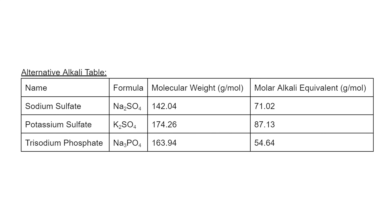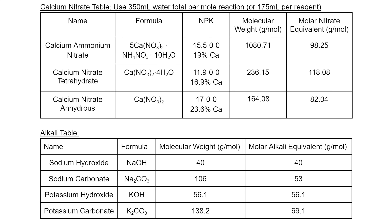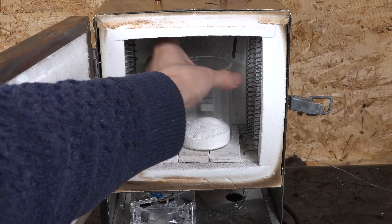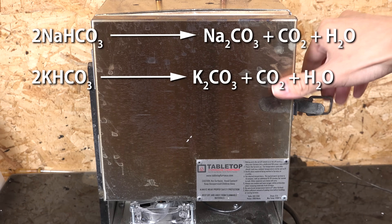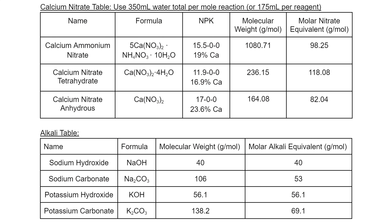If you want to use sulfates or phosphates left over from other experiments, by all means use extra water to dissolve them completely before mixing them in. If you're using any carbonates or bicarbonates like potassium bicarbonate or sodium bicarbonate as your alkali source, first bake them in an oven at 200°C for a couple of hours. This dries them and converts the bicarbonates into their respective carbonates, which is important because bicarbonates have lower solubility in water. This is why my table doesn't list bicarbonates — they are much better used after converting to carbonates first. Additionally, carbonates like potassium carbonate absorb water from the air, so they also need to be dried to get an accurate measurement.